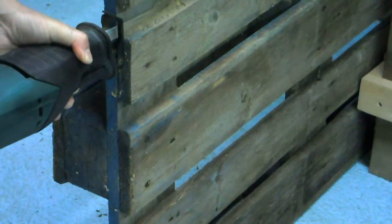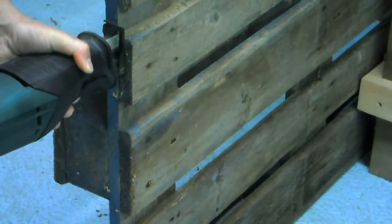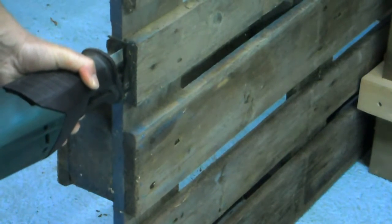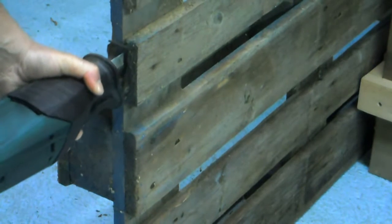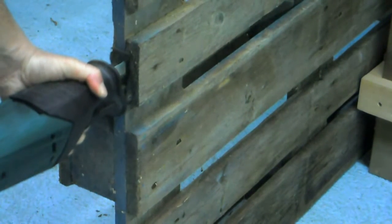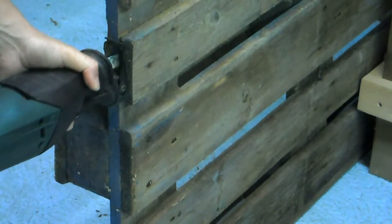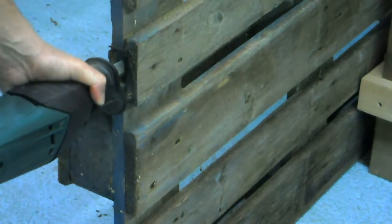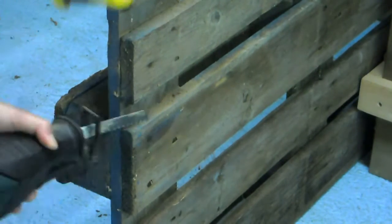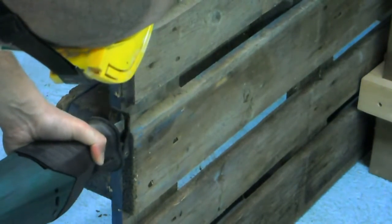It is an easy way to dismantle the pallet boards, but I need to make some effort when the boards hook the saw blade and the reciprocating saw rebounds. And we must keep in mind that when we cut the last nail in the board, suddenly nothing offers resistance against the saw. If we don't stop pushing, we can go headlong into the pallet.